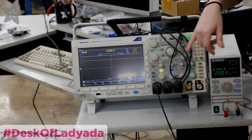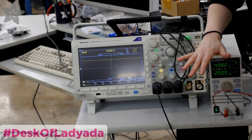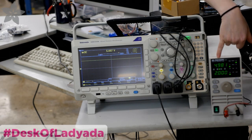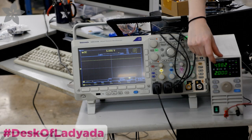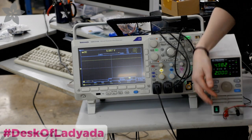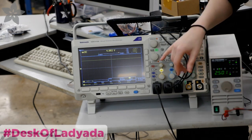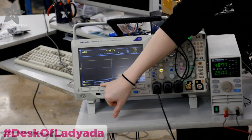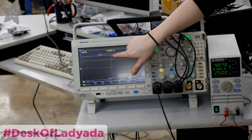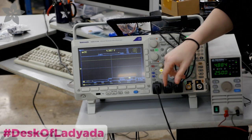Let's go up to two amps. At two amps we do see a little bit of a droop — now it's down to 5.06, but still well above what the rating we want. We basically want at least 4.8, 4.9 volts. You'll notice that the BK Precision is actually getting a lower voltage — like this is 5.05 on the scope but 4.983 on the load. I think that's due to either the resistance from the wires or the internal current sense resistor. That's why I use the oscilloscope to measure. At 2.4 to 2.5 amps, over here we see 4.982, ripple of again only about 300 millivolts, and this is happily supplying 2.5 amps. Still well above 4.75, which is the cutoff for USB. The spec is 4.75 to 5.25 volts.